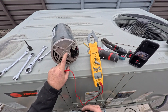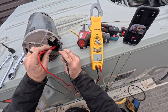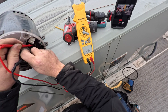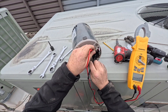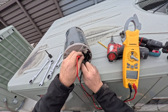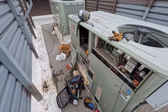Testing the old motor windings: ground to Line 1 — open. Line 2 — open. Line 3 — open, so it's not grounded and didn't pop a breaker. Line 1 to Line 2 is four-point-something but bouncing around — should be stable. Line 2 to Line 3 same issue. The windings are clearly screwed up. That's how you would test it.